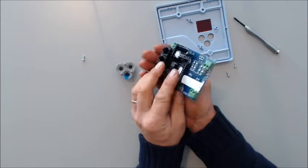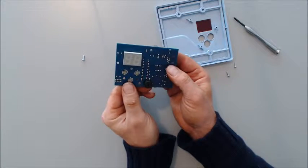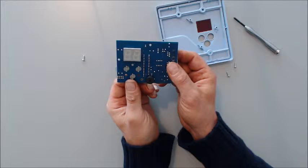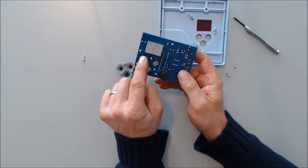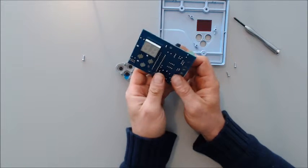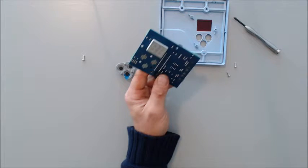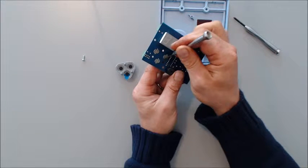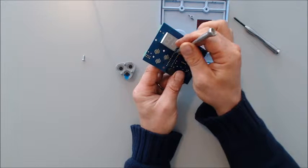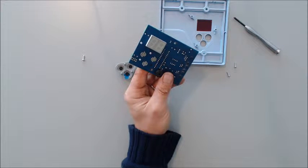And if it's an old timer, or actually I have a couple of these coming out as brand new as 3WG2, there would be a small film on here so the buttons won't respond. What I do is take a small flathead screwdriver and give it a little scrape here, just to renew that surface so that we have fresh copper showing.